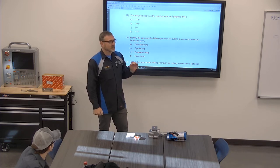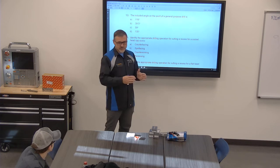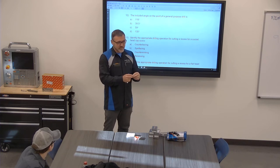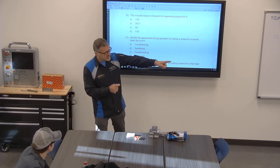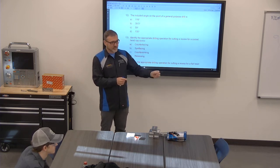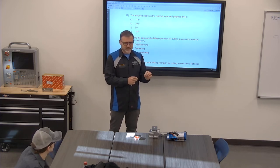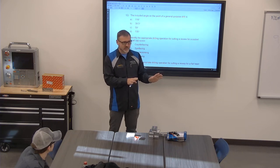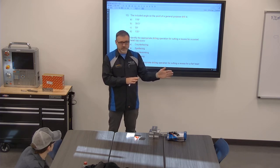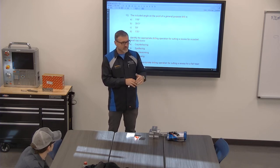One day I'm walking through one of the hallways. We had these really narrow hallways. They were doing the same thing on the CNC lathe. They had the back end of it open, similar to that ST, and a piece of three-quarter brass sticking out the back about this far. It happened all the time. There's a guard that goes over there, so we'd hang the guard out in front of it so people would know you had material hanging out. Once you ran one or two parts, it was in there, you put the guard back on, and everything was good.